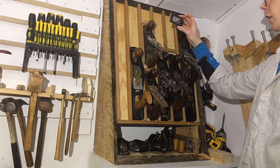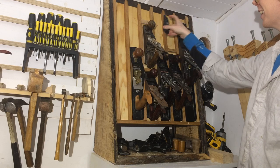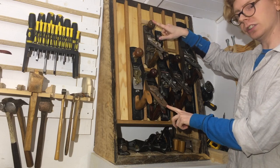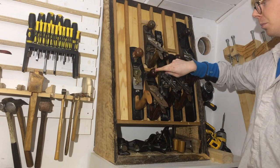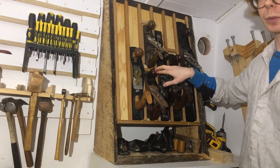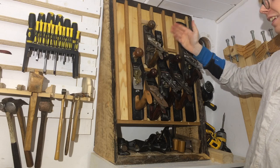This tiny thing I found in an antique store — it's probably not particularly antique, it's made of plastic, but it was cute and I wanted it. These two are from a Swedish manufacturer called Ankar — a number four and a number three. I haven't tuned them up so I'm not using them yet. I plan to make the number four my dedicated smoother, since I kind of use this number five as the smoother now and it's too long. The number three will become a scrub plane with a very small radius camber so it can take a very deep cut.